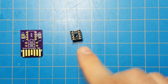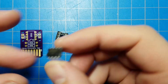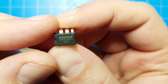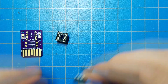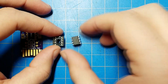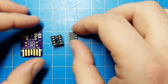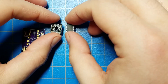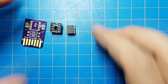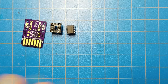I'm going to have a socket — dual wipe, not machine holes, but dual wipe — that will make removal of the memory chip a little bit easier. That's a Winbond 25Q32JVAIQ. The JVAIQ deals with the package and specifications, but the 25Q32 is the important part — that tells me it's a 25 series flash memory chip with 32 megabits, or four megabytes worth of storage.